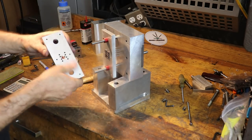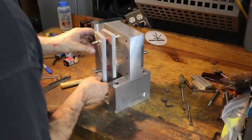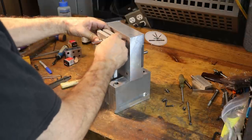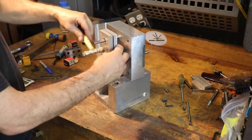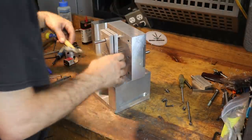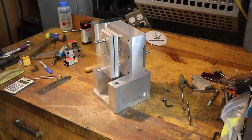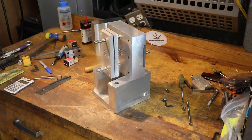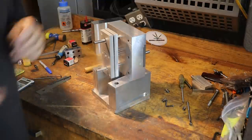Okay, so here's the back of our ejector plate, which basically just houses or contains our pins, and I'm going to pre-align it on the thousandths or so clearance that I added for the back of the bushing blocks. I'll give it a little tap. Oh, well, actually it's seated, because our ejector pins are 1/8 inch, and that's 1/8 inch thick. Okay, so let's screw our ejector plate together, because this mold's got an appointment with a molding machine, which in all likelihood I'll probably load in the morning, because it's, I don't know, 8:30.